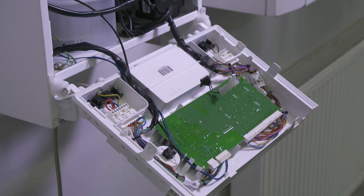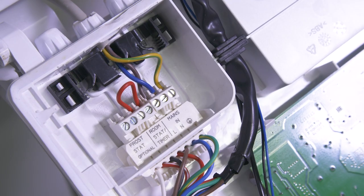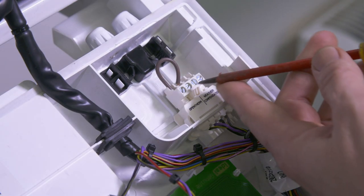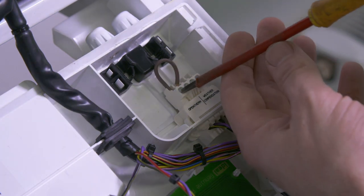Locate the wiring terminals within the control box. The 230V connections are on the left and low voltage open therm connections are on the right. Remove any existing controls located in the room stat or timer plug and replace the red link wire, which would have been fitted to the boiler when it was manufactured. Wire the smart interface bracket into the open therm connections.